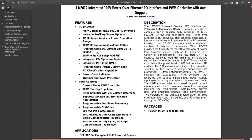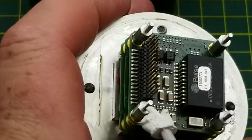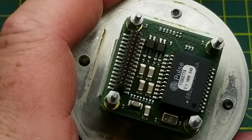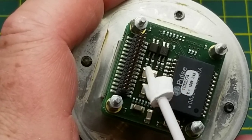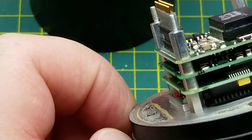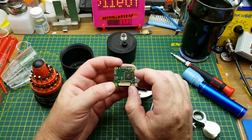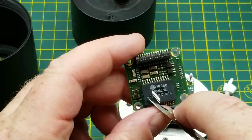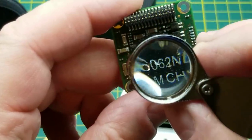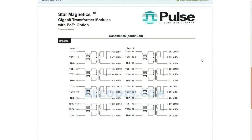The next board down in the stack looks like it is connected to all the pins on this header. It has a big chunky chip on it, what appears to be a crystal, and then just some passives and a couple of four-pin devices, and it looks kind of busy on the back side too. There's a good-size chip on the back — H6062NL. Oh, it's not a chip at all — well, sort of — but it is a Pulse gigabit ethernet PoE transformer. So that isolates the data from the power — it's just a set of transformers.